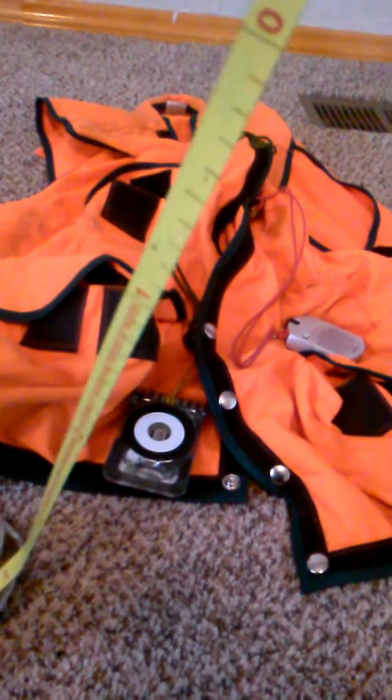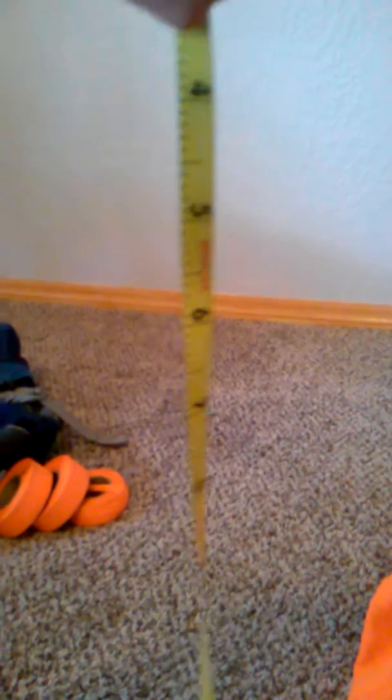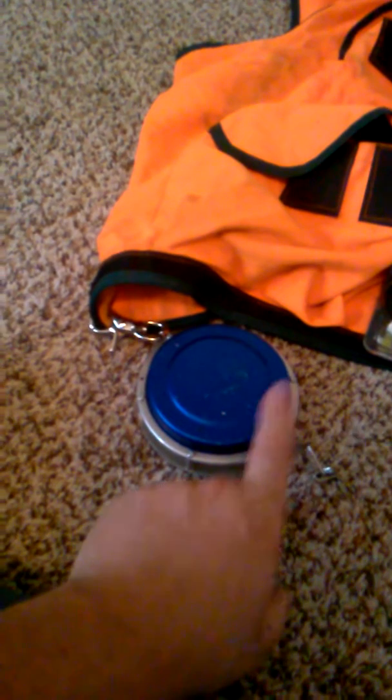This tape is used to measure both diameter and distance. The diameter side only goes out to about twelve or fifteen feet, while the distance side goes out to seventy-five feet. Loggers use these to measure tree lengths so they know what lengths to buck them up at so they can fit on haul trucks and be taken to the mill. The most common distance I use for measuring with a logger's tape is sixty-six feet, which is one chain.